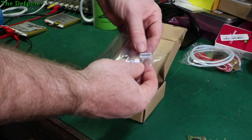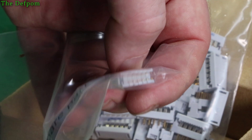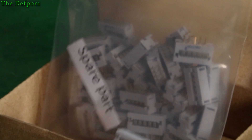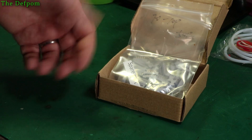These are 10-pin flat ribbon cable connectors. You've got a 10-pin header on the bottom. You make a circuit board with a standard header footprint, then put a ribbon cable straight onto it and crimp it in. No soldering, no connectors falling out. They're also much more compact than using a header and a separate connector at the same time.